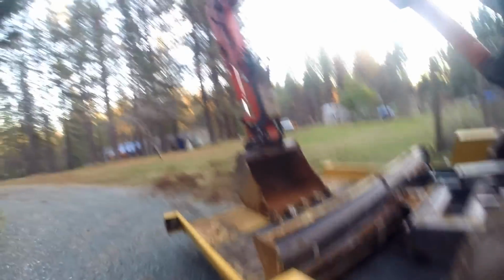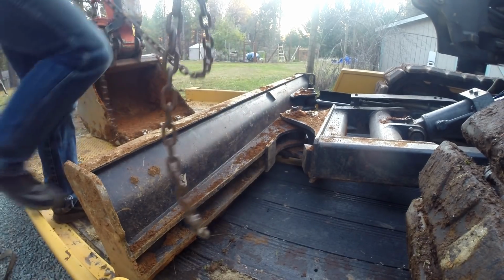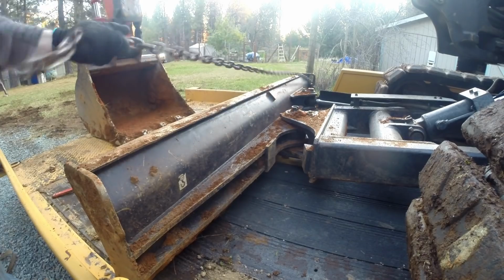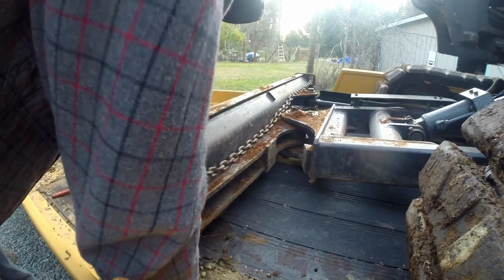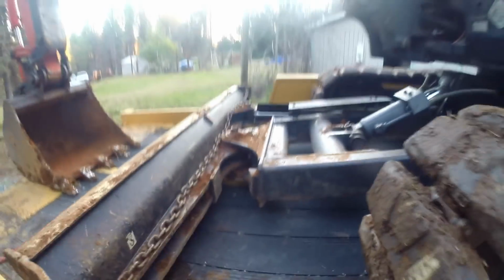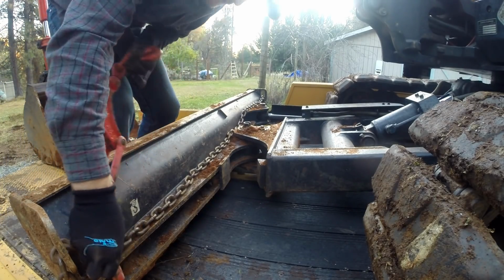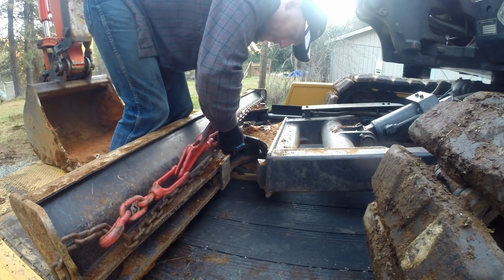And so how I hook up is with the one chain binder that I actually use on this, because it's so much easier to use the ratchet straps. I run a chain over the blade through its loops, tie it to itself right there. Then I'll snug this up, put my snap binder right there, and that is good. I think this is one of the old snap binders off the log truck. He left it on the job because it's dinged up or something, so it's not.